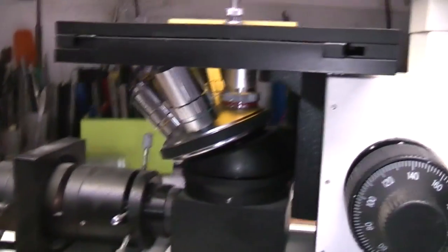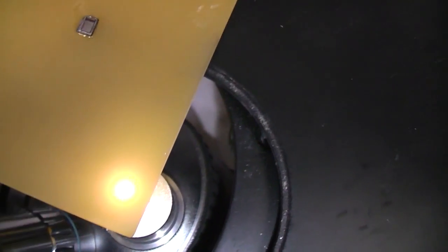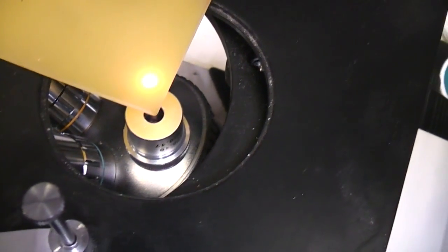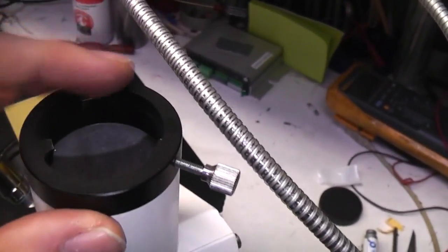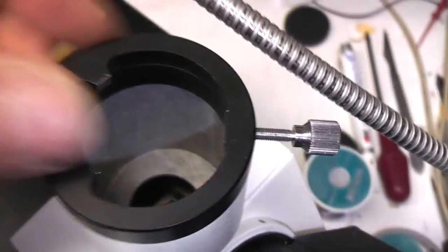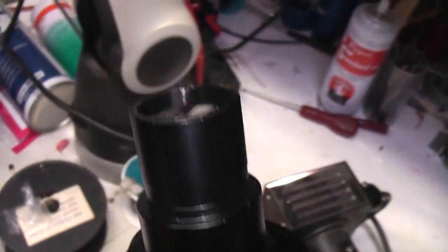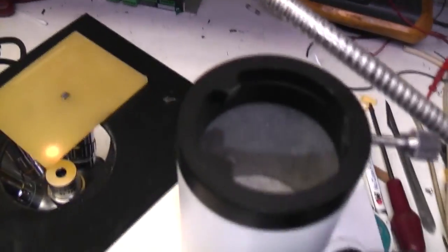This is a little bit unusual because it's upward-facing, but the critical thing is that the actual light comes through the lens. There's basically a light source here and a beam splitter so it actually shines the light up the lens. It's used for looking at surface detail rather than more conventional microscopes that look through translucent objects — this is technically called a metallurgical microscope. It's actually got a top port for connecting cameras to, but I found this doesn't work all that well. You actually have to flip the mirror out to get the light path through, and the mounting doesn't seem to be that good for the Canon EOS microscope mount — there's nothing to really hold it straight.